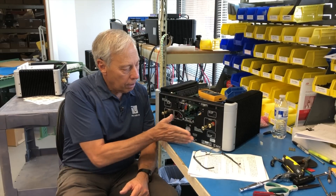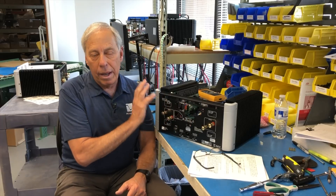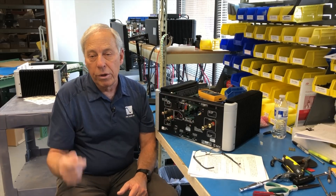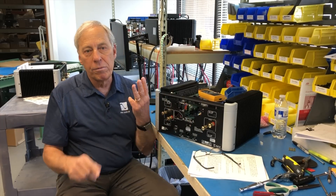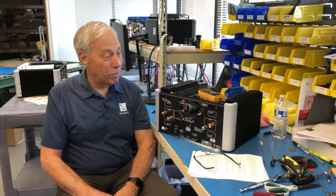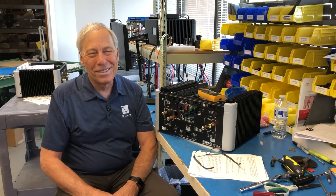In general, if it's a modern amplifier and it has enough power — which most of them do — then you can drive a 4, 6, or 8 ohm speaker without a problem. I hope I haven't befuddled you too much. Thanks, bye.